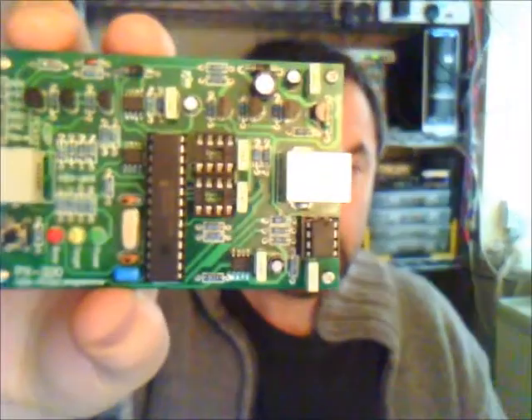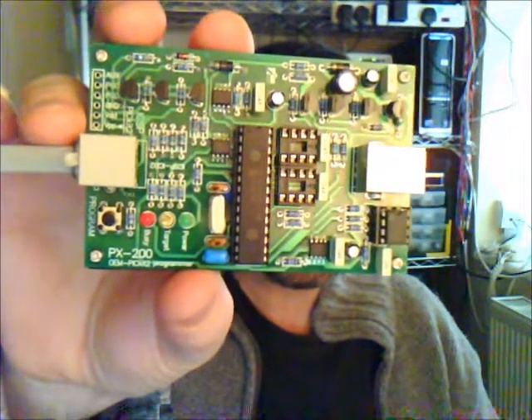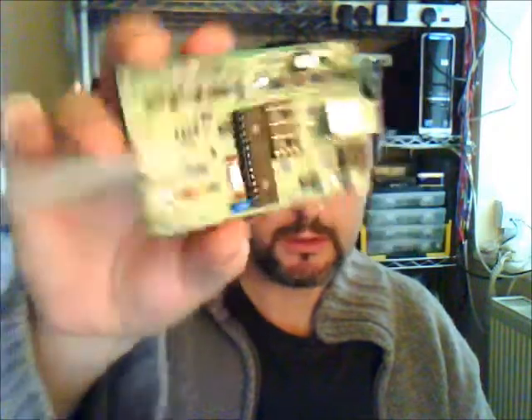It's a PIC-based robot using the 16F887 microchip, which is probably not the option I would go for nowadays, but it's still pretty good for what this robot has to do. It comes with various bits and pieces which I'll show later. This is the PicKit programmer — it isn't really the original PicKit, but since the project is open source, these guys made their own. So with the robot itself you even get this programmer, which you can reuse for other purposes.